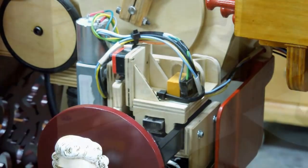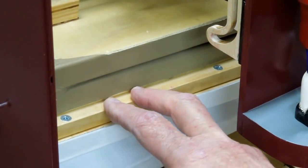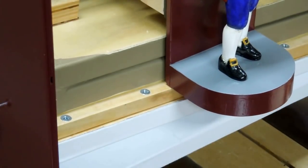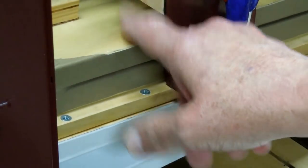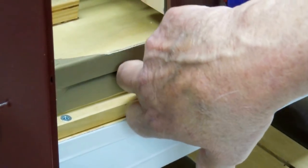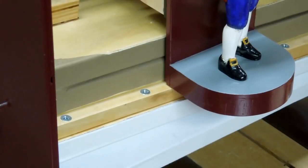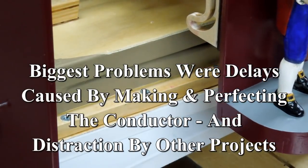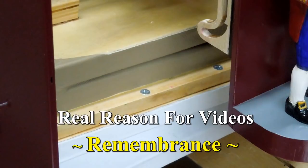Then you have clearance problems. This is the base of the reservoir and the top of the bellows — this is stationary. But when this retracts, it has to come back here, and you have to make sure the bottom of this thing will not touch the reservoir when it's expanded to its full point of inflation. You want to stay clear of this leather. There's always a chance you'll forget and turn the organ on before you extend the conductor — you don't want the reservoir going up and down tearing up this leather. It's very easy to lose track when you're working on the test stand, so you have to keep checking.